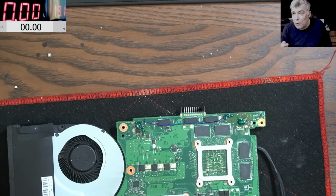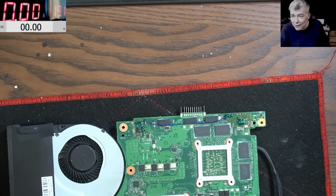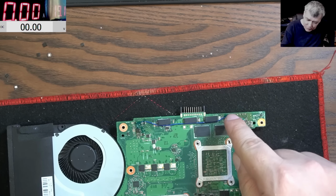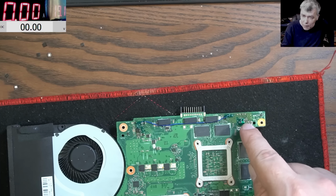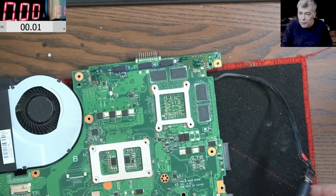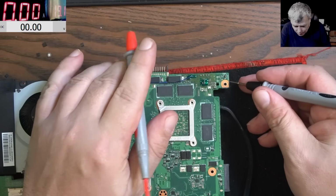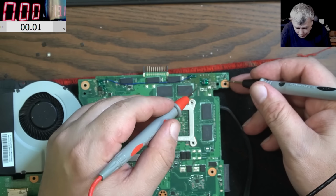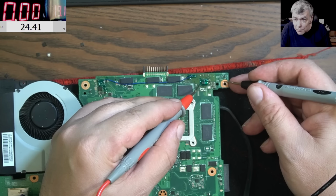It took me 2 hours to understand that both chips from eBay are not working. They are faulty. And the original one, which is working, the problem was a track from here to here. I mean, the MOSFET was blown up, you remember? And I used a wire to build up the track. So the charger is plugged in. And now if I check on the gate of the MOSFET, check there. The gates are together, keep in mind. Check on the screen, 24.4, you can see.